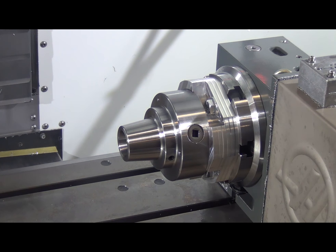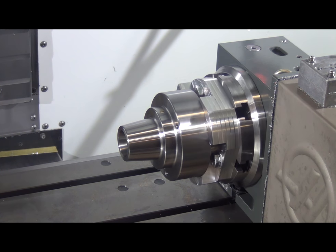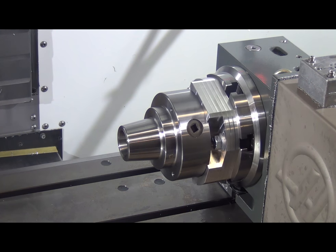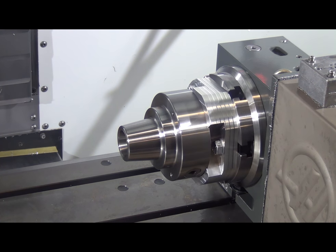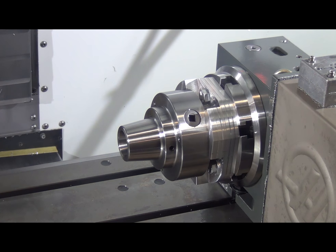We got it all installed, had to do a design modification, made a separate part, but at the end, it's pretty much the same thing. We now have an adapter plate from our HRC160 to the 5C adapter, so we'll be able to get those mag catches going. I dialed it in. We have roughly 1.5 thousandths runout along the face here. For what we're doing, and once we get that fixture in there, I'll be able to adjust that and get that going.